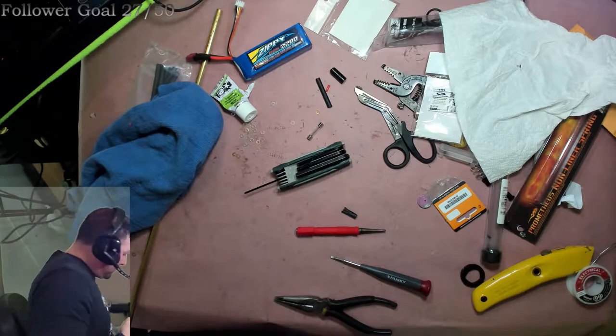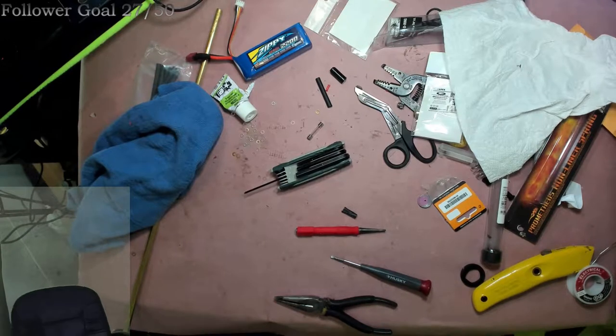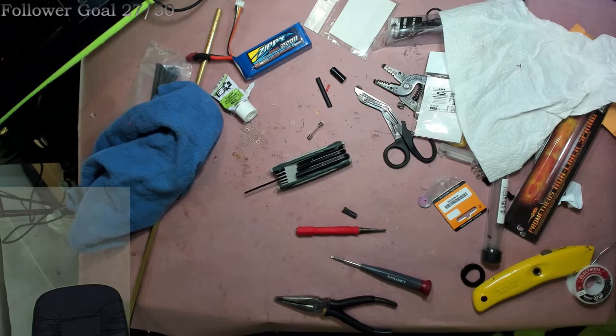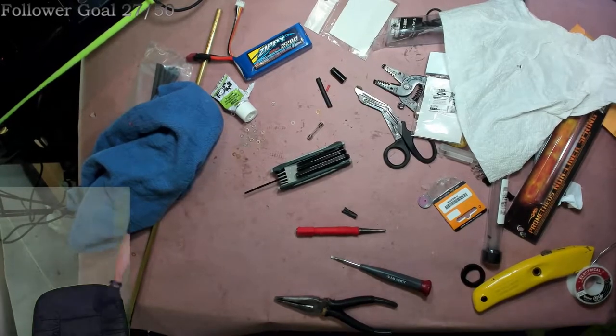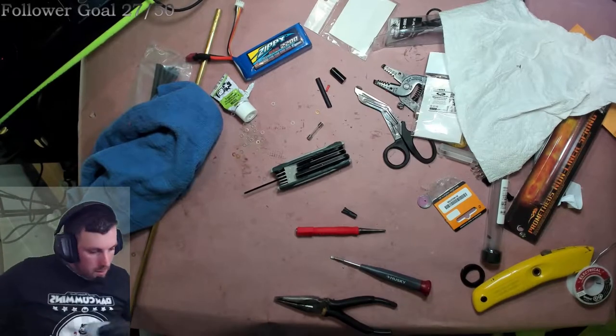Regarding the dangers of boiled linseed oil, you've maybe heard of oil-soaked rags spontaneously combusting? A lot of times they were soaked in boiled linseed oil. That being said, any rags that you create with this should be stored in an airtight, fireproof container or disposed of in the proper manner, probably in a fire pit at some point. Just whatever won't cause your house to burn down.